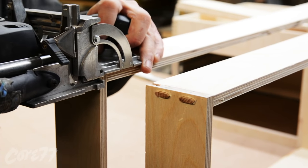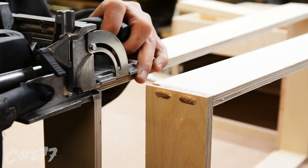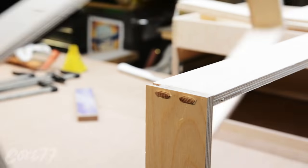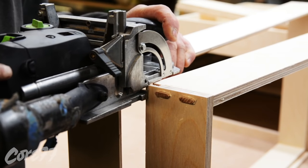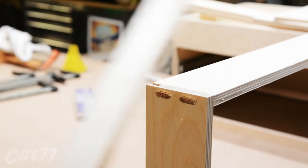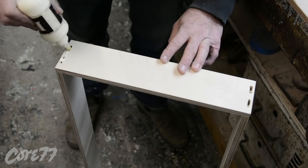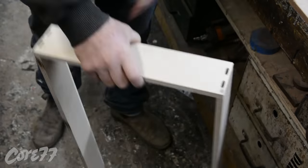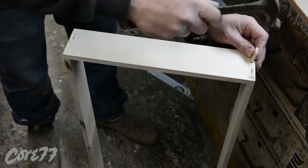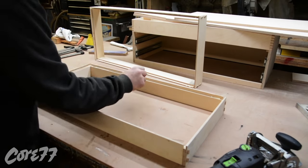I have a little marking gauge made up of wood so I get a consistent placement. This is something I did by accident once — I put a domino through from the inside out, it came all the way through, and I thought that might be an interesting look. So here I'm using it, just using dominoes as nails basically, and then showing them so they look good.